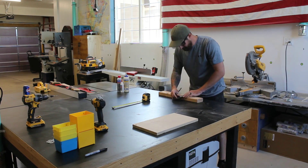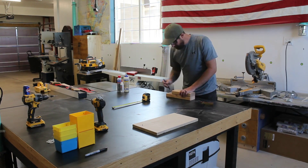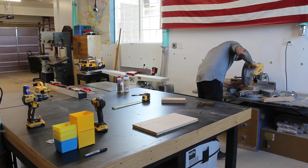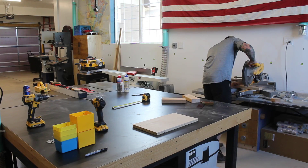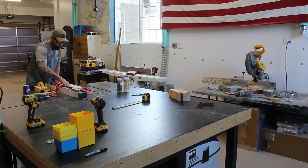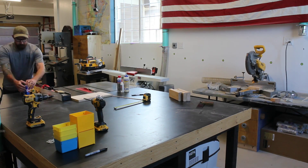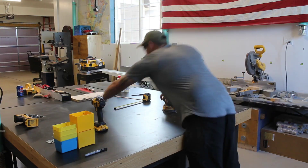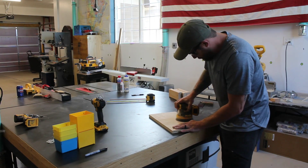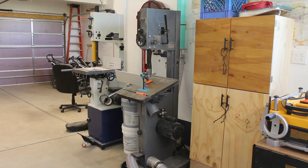This is for me an exercise in how well can I plan ahead. So I made the cut on the first support block and used it to measure the remaining two. I made those cuts on the chop saw — I already had the fence set to one dimension, made the cut, moved it to the second dimension, made the second cut. A sip of beer, and then it had a little bit of gunk on it, so a quick hit with the random orbital sander takes care of that. Then we'll fly across the room over to the bandsaw for the next series.